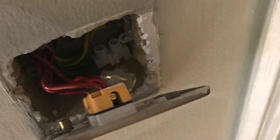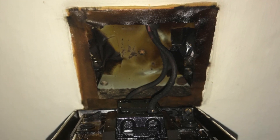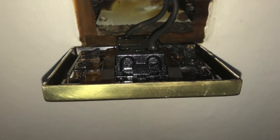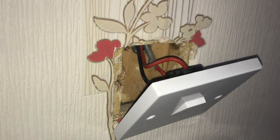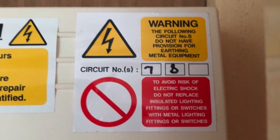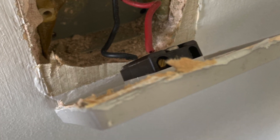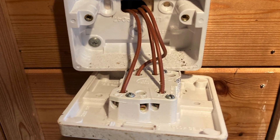We check all metallics and go through everything with a wander lead — anything that doesn't ring out we drop off and have a look at. Nine times out of ten it's a dry lining box. Sometimes this is where you find all the wooden back boxes as well. If there isn't any CPC at any of the switches or lighting circuits, even though they've got plastic fronts, you've still got to have screw covers because a live cable could still go down to the back box.